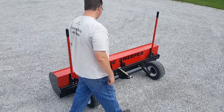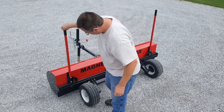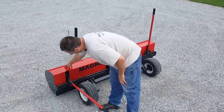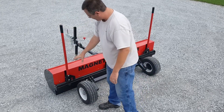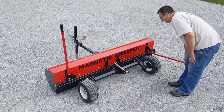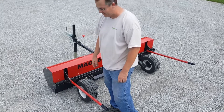This unit is fully enclosed — the magnets are inside this housing here inside the lid. To clean the magnet off, you simply pull down on these handles, and when you get to the bottom, the magnet just sticks to a steel tube that's in the top here so you can pull the vehicle ahead. So you drive around with the handles in this position, then you stop the vehicle, flip both handles down, and pull the sweeper ahead and your metal debris will stay laying on the ground.